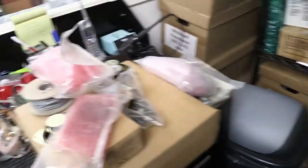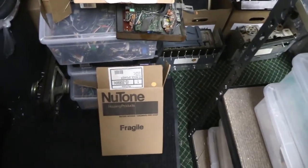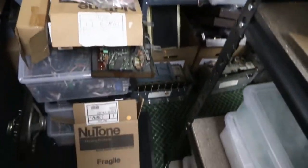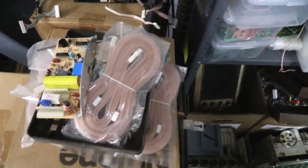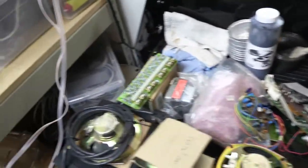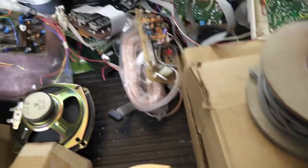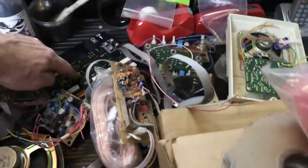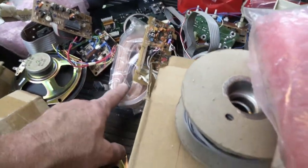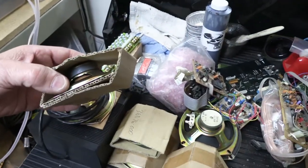If we walk through here and look on the little workbench - this is where it is when I tell people your intercom's on the little workbench at the office. There's some 8-inch speakers for 2003s, 3003s and 4006s. There's another 3303 down here - that's going to be featured in its own video. There's a bunch of AM FM dipole antennas, always good to have. There's a grill assembly for an IS79 patio speaker, some switchboard assemblies, terminal board for a 303, terminal board for an SM428, a brand new in the box i829 chime module, an IK15 circuit board, a 4006 tuner board, another terminal board, another chime module, terminal boards for a 4006, another 4006 tuner board, more dipole antennas. There's a whole bunch of 5-inch speaker cones, all brand new, and a few 3.5-inch front door entry station speaker cones.